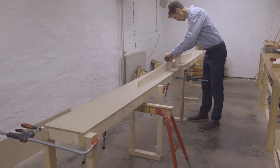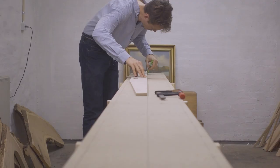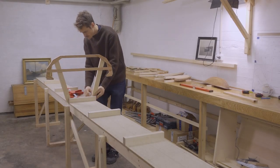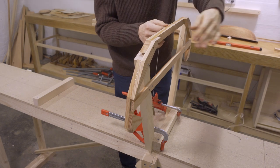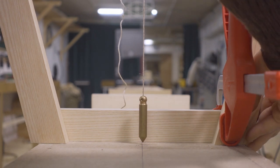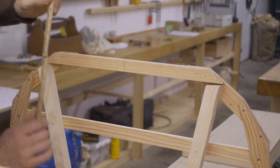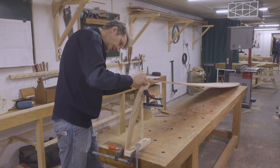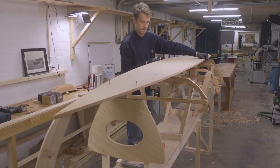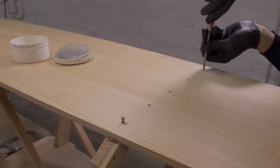Now it's time to set up the framework for the boat. I've built a strong back and I've made sure that it's perfectly straight and level. At the middle of it I've drawn an accurate center line. Now I'm attaching the frames and the bulkheads to it, making sure that the correct spacing is specified in the plans. They also need to be perfectly plumb, square and at the correct height over the strong back. Then I screw and glue the stems to the ends of the bottom panel. The bottom and stems assembly is then placed on top of the frames and the bulkheads, and after making sure the alignment is correct, these parts are screwed and glued together.